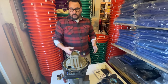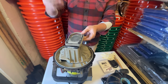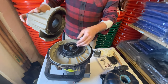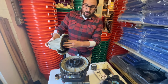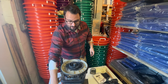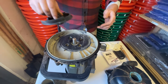This pump has what's called a volute — this is where your pressure is built. Water goes in here and this is a volute check, just a check valve to keep the water from going back out. This is your volute where the water is swirling around. It goes against your impeller and against the volute, builds all the pressure in here, then sends the water where it needs to go. Your impeller, like a propeller, has blades on it and it spins.